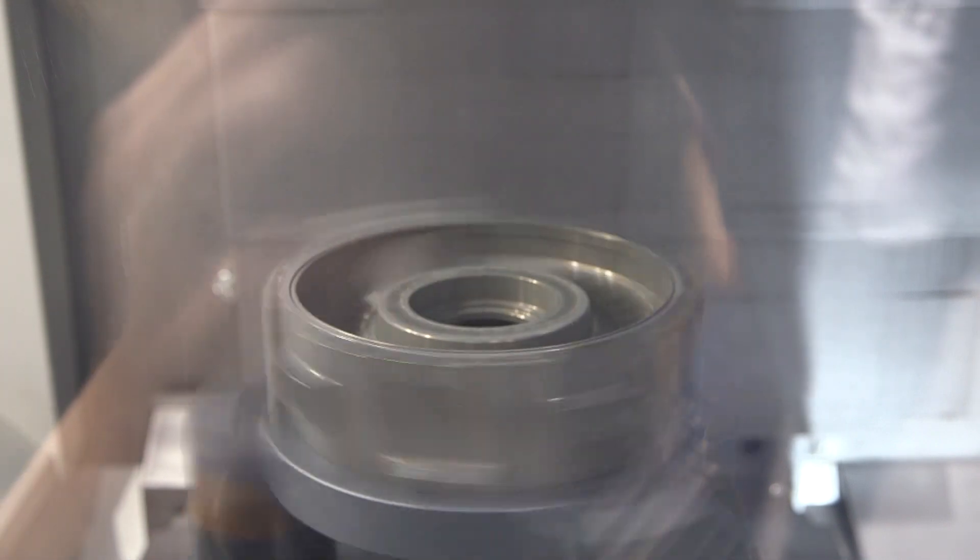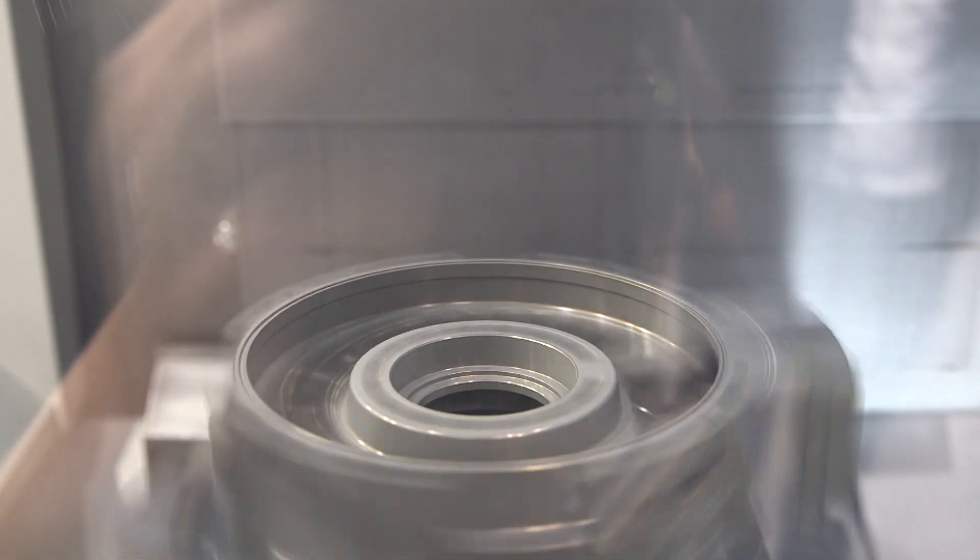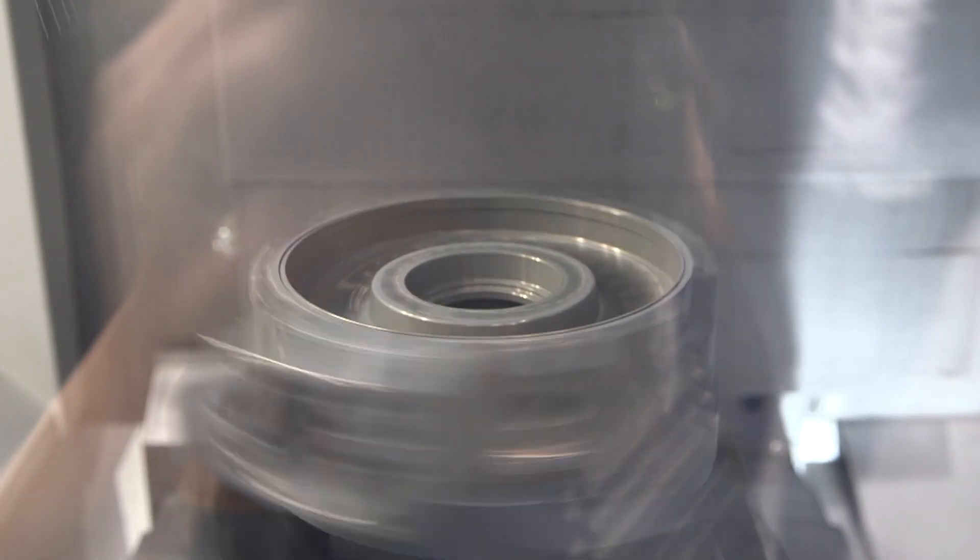That B-axis — what's the motor power? On the B-axis here we have a motor spindle and that's up to 34 kilowatt, which is quite a powerful spindle for the milling and drilling tools. And of course the main spindle has a maximum power of 106 kilowatt, but actually at 100% duty cycle 84 kilowatt — so that's no mean available power level.